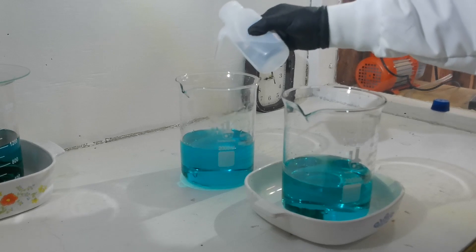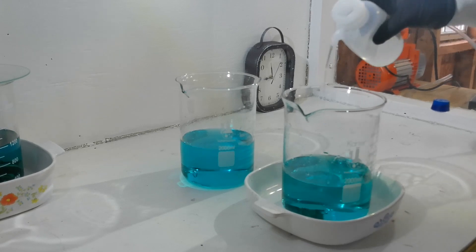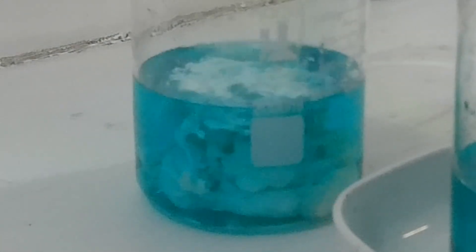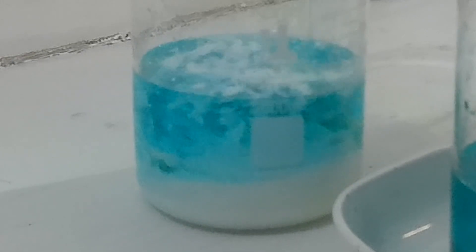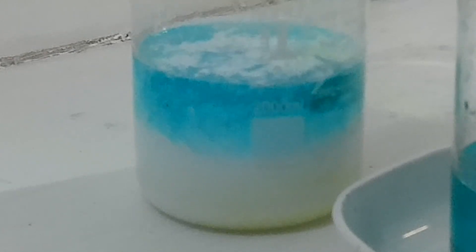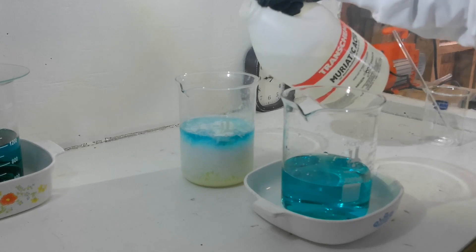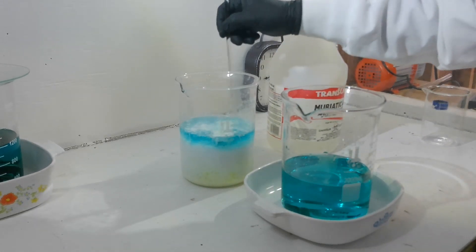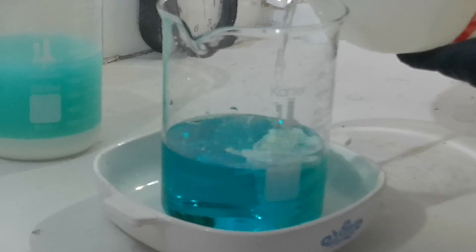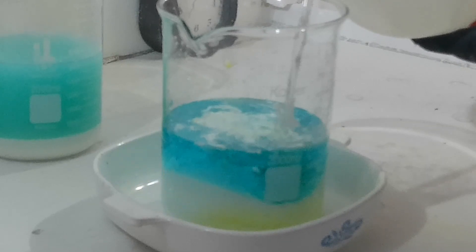We need to make sure we get every little bit of our solution. Get our sides all rinsed down here and get ready for our precipitation with hydrochloric acid or muriatic acid, which we will use to precipitate the silver from silver nitrate to silver chloride. It will appear as a white fluffy cloud. Looks like a parfait. I do add a bit much muriatic here, but it is pretty.